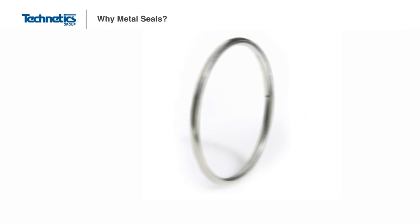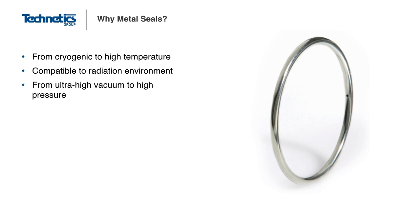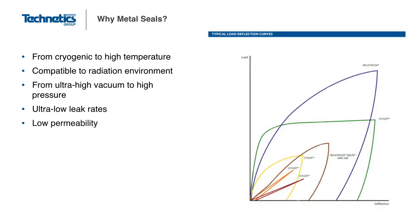Here you can see a number of advantages. Metal seals are more resistant to higher temperatures than traditional polymer, elastomer, and graphite seals. They will not harden when exposed to a radioactive environment. The fact that they are not gas permeable allows them to support ultra-high vacuum environments. They also resist extrusion under extreme pressures better than conventional seal materials and are resistant to breakdown in corrosive environments. Metal seals have an indefinite shelf life and excellent longevity in service.